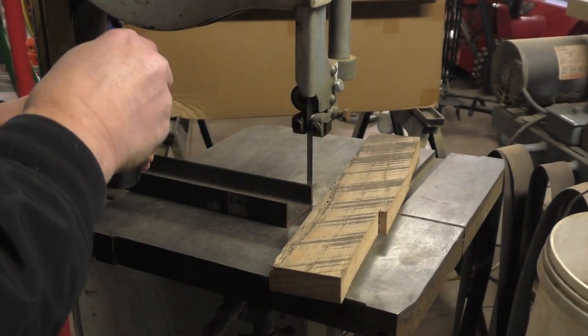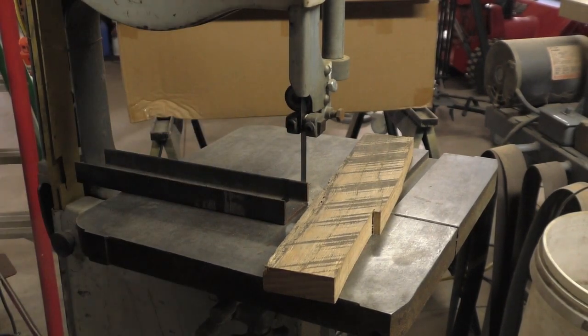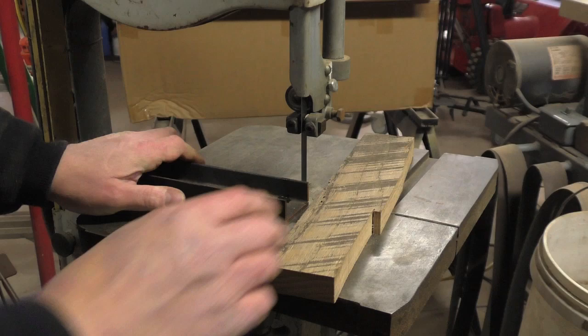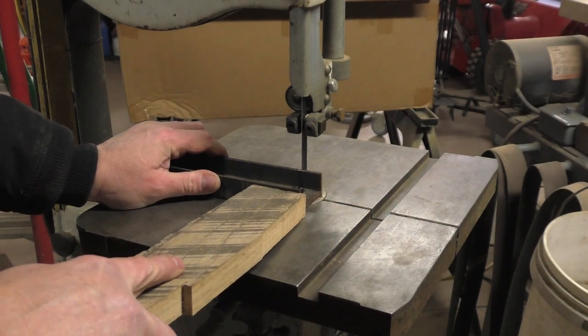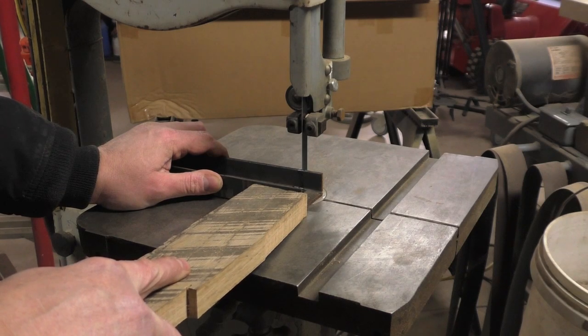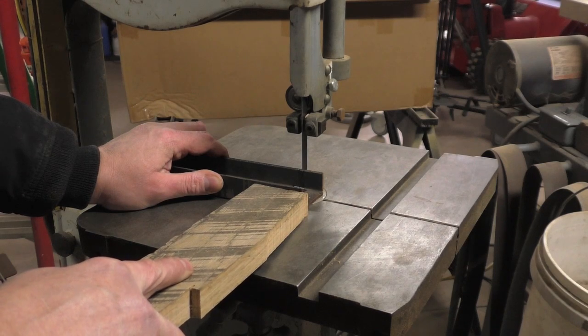One thing I saw in the last video Tubal Cain, Mr. Pete, made is he started to use cutting fluid, lubrication. I always use it on these blades, and I'm also using a bimetal blade, really one of the best blades you can get for cutting steel. Let's try it. Yeah, it's sawing out. That's about 1 inch of steel right there.